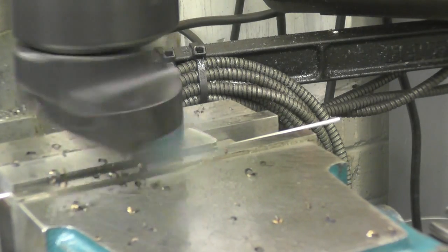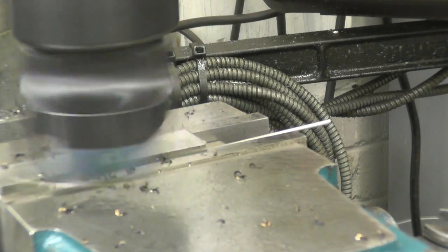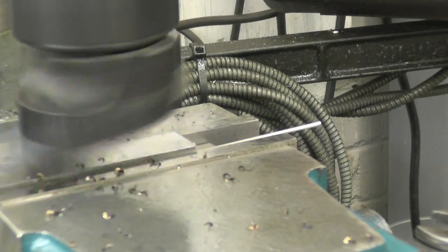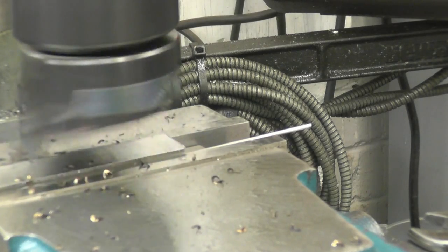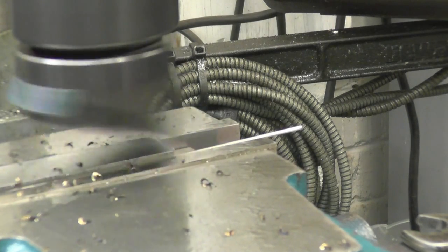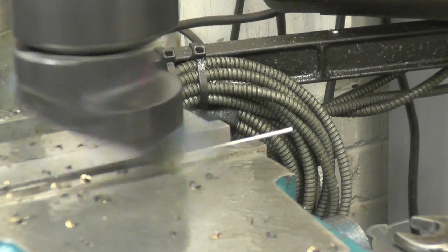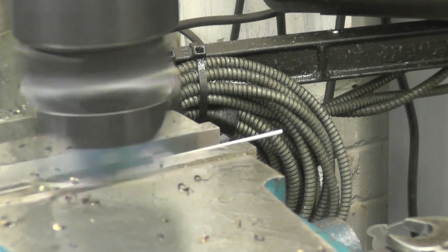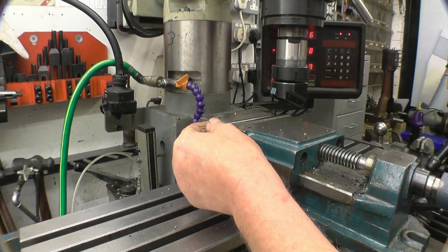It's taken a cut on the front of the cutter, and when it comes onto the back of the cutter it's just barely kissing the job, which means the tramming of the mill is right. I get a lovely finish with fly cutting - I call it fly cutting because all the bits that are cut off, the swarf, fly everywhere.